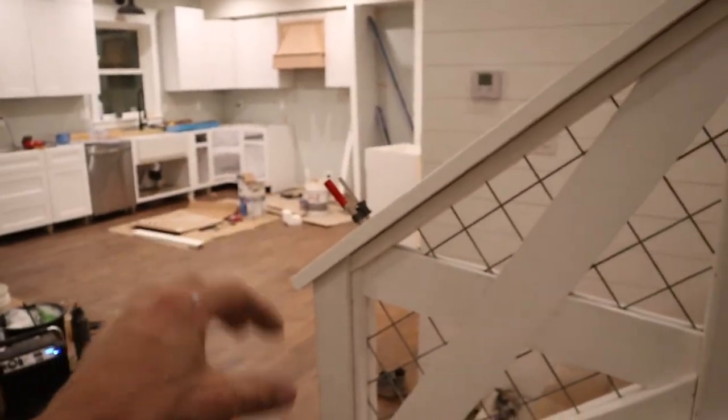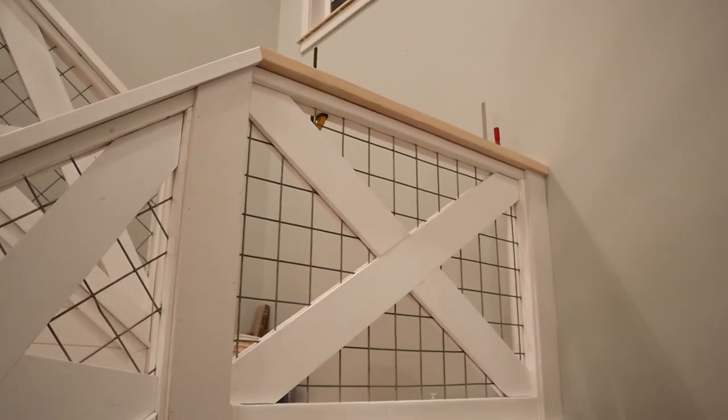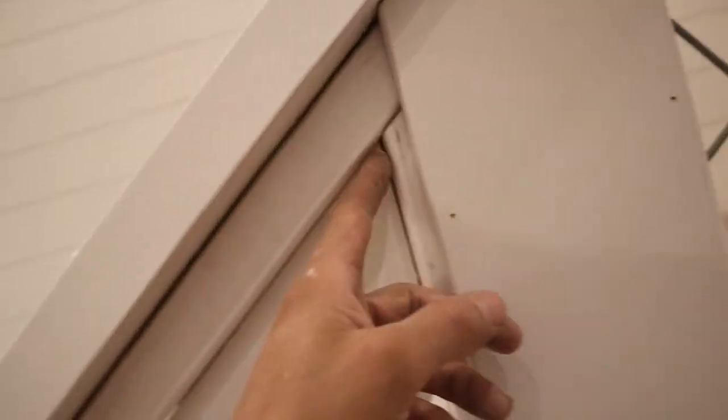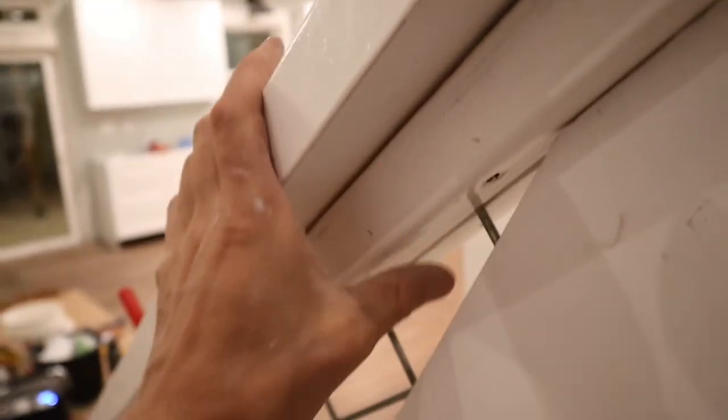I went and got this up. It did have a little bit of twist so I tried to clamp it down as much as I could - probably put a little more fasteners than I would need to if it wasn't twisted. I did put some screws in since I wanted to pull this down especially with the twist. This one will still need to be finished, so I'm not going to attach it yet - I'm going to spray it and then bring it back and fasten it. What I'm going to do is take caulk and fill all these corners, spackle in the nail holes on the flat surfaces, and then we can wrap this thing up.